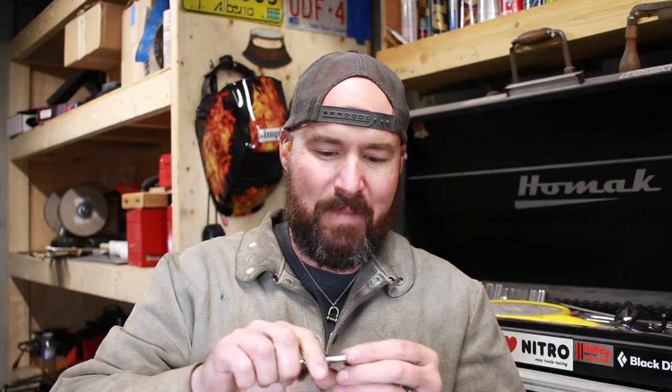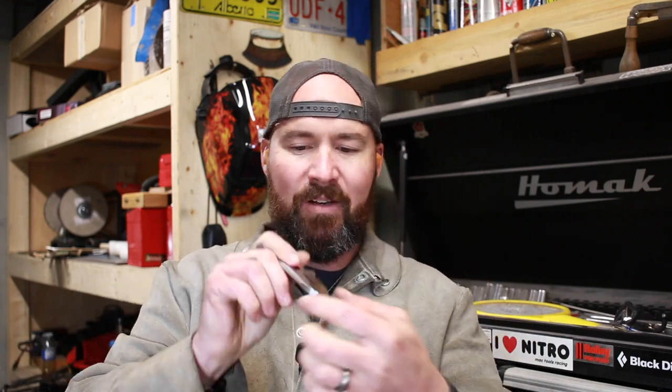My thoughts are maybe the fact that once you've got your main bevel established, and this is a 10-inch contact wheel that I'm using, once you've got it nested into the wheel, it's easier to keep it there. Whereas a flat grind, I don't know, maybe that's just my thoughts, but in theory there's more surface area contacting what you're grinding against, the wheel, than on a flat grind. If this was a straight line, there would be less actual distance of contact, so maybe you just have more area to contact when you're hollow grinding.